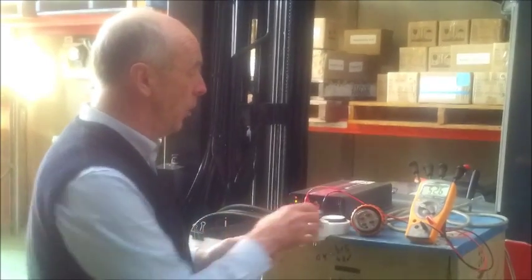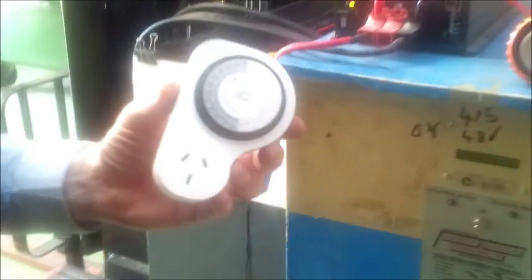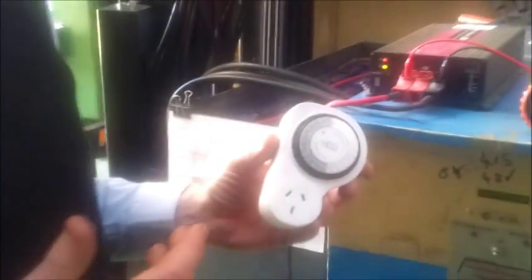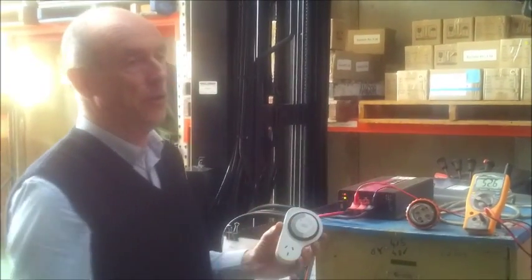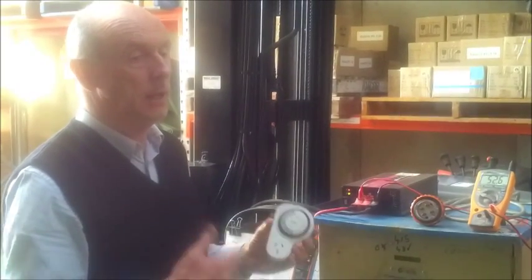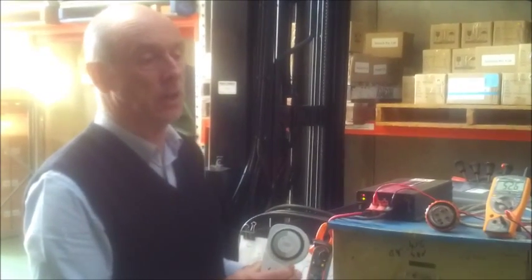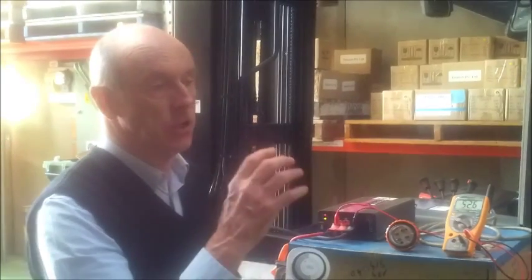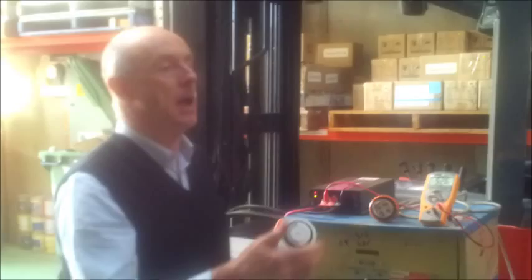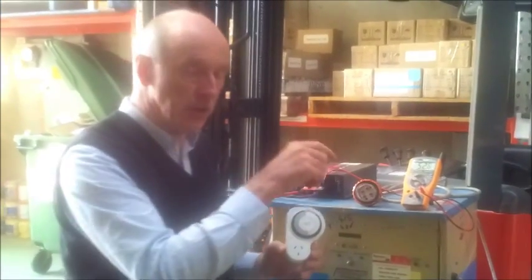All you need is a single phase timer and you can run it overnight for 8 to 10 hours. You can run it off-peak to save on electricity — here we charge off-peak at around about 9 cents a kilowatt hour. We run the battery charger all night for about 8 or 10 hours, and in the morning you come in and it's ready to go for the operator, fully charged. When I say fully charged, it's got a 100% state of charge. We know that by measuring the DC voltage three hours after it's finished charging, checking the volts per cell to confirm they're all equalized. From the total voltage and voltage per cell, you know the traction battery is back to full state of charge.